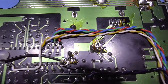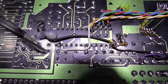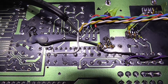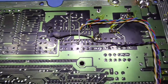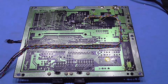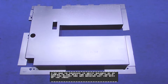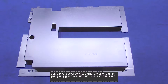Following the wires back up we come to the next set. We can see the footprint of the video encoder — the outputs go right to left: red, green, blue out. We have our composite out as well. Not many people wire this in but I've done this as C-sync out, so if you want to use C-sync you can — it's on pin 7 of the DIN. Now I've finished this I need to get it all back together. The paint on the shield has dried — I gave it a spray and it's all dry, so I'm going to get this all together.